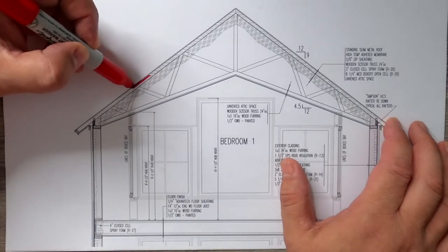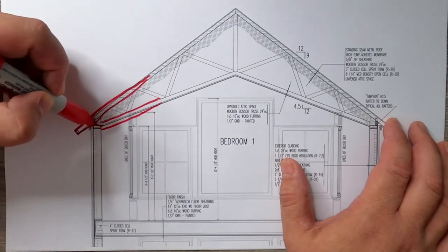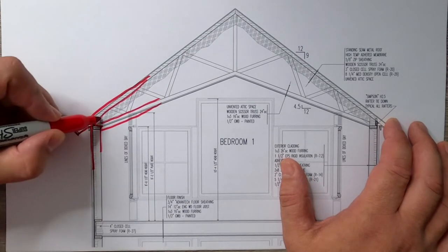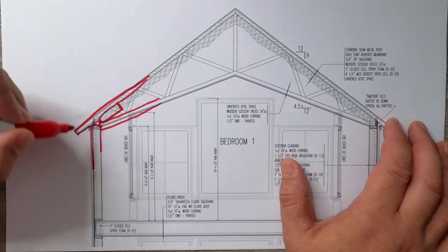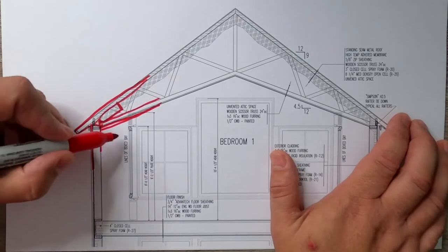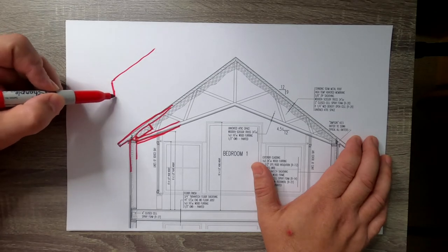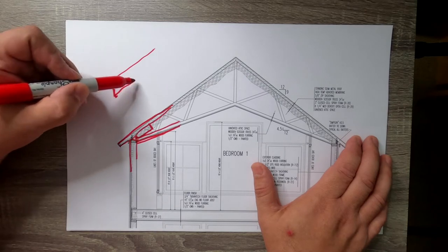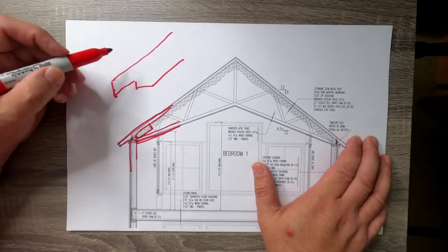So out there we talked about — here's that truss, top cord, bottom cord, and here's our wall. And in here they had what's called a slider — raised heel, energy truss. The issue here was that beyond this roof, we had a whole cut rafter system, meaning we had our traditional two-by-twelve rafter that got cut with a nice plumb cut, went back up to the bird's mouth across the wall, and was our rafter there.